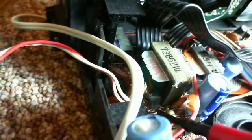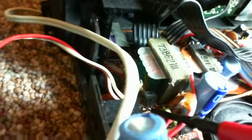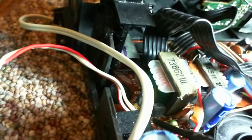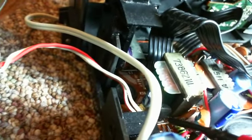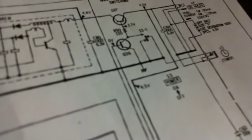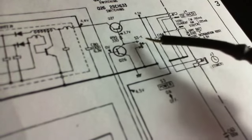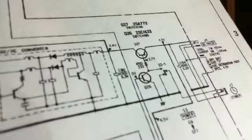Right down in here. I'm on there and 0 volts. Okay, I go on the center pin. 0 volts. I go on the top pin. How does that work? 0 volts on all pins. Zero volts on all pins. Switch not on, because the switch is actually driving this. Okay, let's switch off and see what we get here.